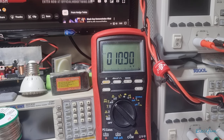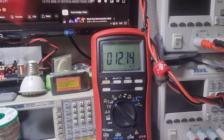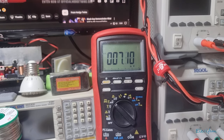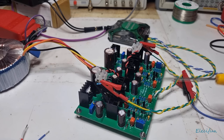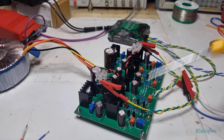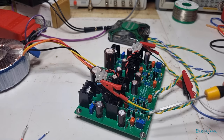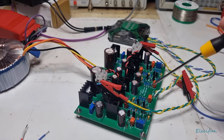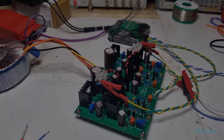I've done this three or four times now and I'll do it again with some other cables I've made up. You can see it gets around 20 millivolts and below on both sides — this one seems a bit more stable than the other side. You've got to consider that these components from China for these kits aren't the greatest, and the pots probably aren't that good either. I don't have any 500-ohm replacement pots to try. But anyway, that's it — thanks for watching and I'll catch you in the next one, guys. Bye bye for now.